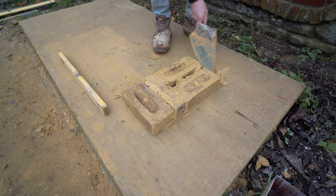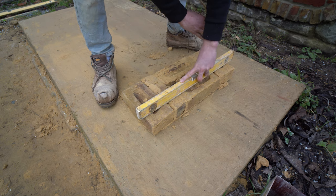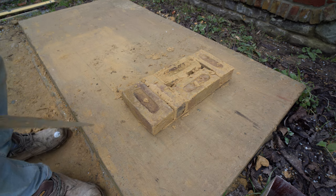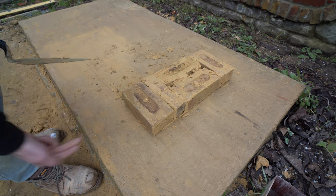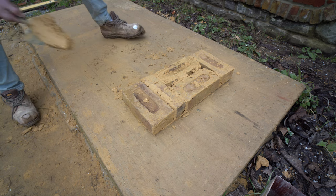Always remember to clean your snots up. That's a bit of a bendy old brick — make sure it's nice and level. That is what your first course of Flemish Bond will look like. I'm going to build two courses up and then show you from ground view, so you can hopefully get a better idea of how the bond actually looks from eye level.